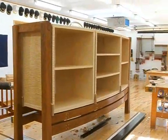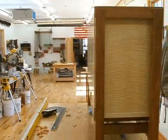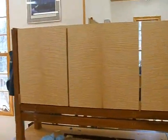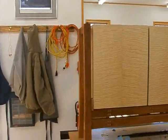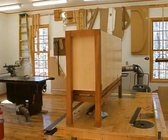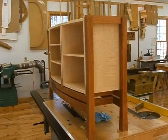Now I'm going to fit the boxes onto the stretcher and leg assembly, and it's really critical to get these exactly right. The curve on the front of the boxes has to match the curve of the front stretchers — there can't be any gaps or discontinuities with the curves. At the same time, the backs need to be flat and all in the same plane, all the heights have to be the same, and the gaps between the boxes have to be parallel — they can't be wider at the top than at the bottom. It takes quite a bit of finagling to get these exactly right. Then I mark where the bottom stretchers intersect the boxes so I can take the boxes off and drill holes where they'll be screwed into the bottom stretchers.